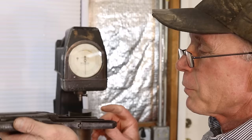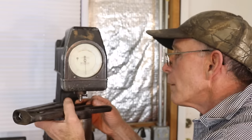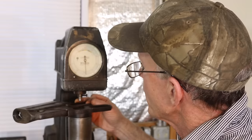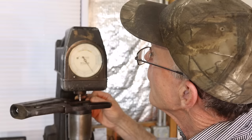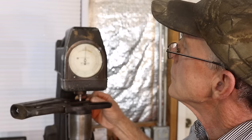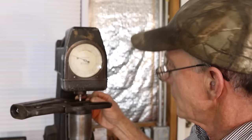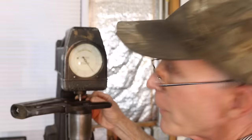Now this one's a little trickier — it's a 1895 receiver. We don't have a removable lower tang, so we'll see if we can get this in here and tested. This one's in the 400,000 range, which puts it about 1917. It was a 30-40 Krag, so it would have had a nickel steel barrel, but we expect a mild steel receiver. We test it and land at about 71 — right in that 70 to 80 range where we expect to find mild steel.